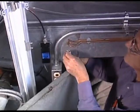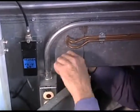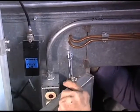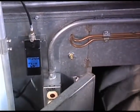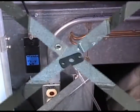The pressure sensor model A308 is used when the installer has access to the inside of the duct. A washer and tightening nut allow the installer to mount and tighten the barbed pressure pickup from the inner side of the duct. Drill an approximate 7/16th inch diameter hole. Next, position the barbed fitting with a washer on front and back. Hand tighten the nut on the backside washer. Tighten the barbed fitting with a 7/16th inch wrench. After mounting the A308, connect the pressure tubing to the barbed connection.